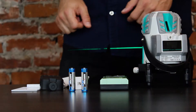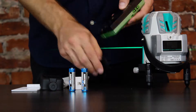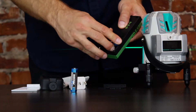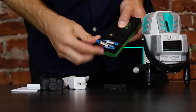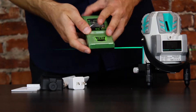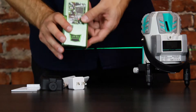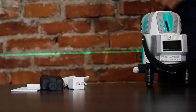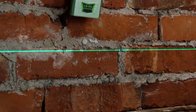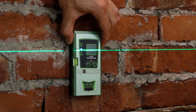Now I'll demonstrate how to use the receiver. The receiver takes two AA batteries and is used to locate where the level projection line is. It's particularly useful for setting a grade in construction projects. I've added a link to a couple videos in the description demonstrating the correct way to do this. To power it on, there's a power button located on the front. You can see here I've got a horizontal line projecting against the wall. As the receiver detector is moved close to the line, it begins to beep.